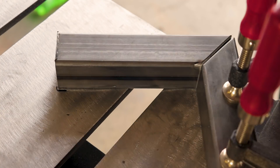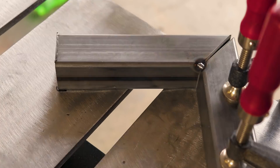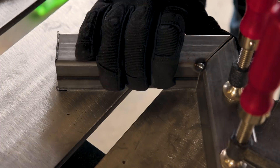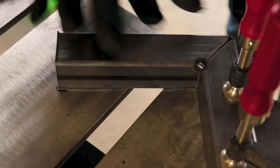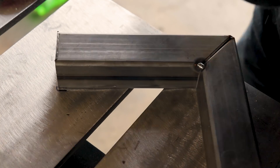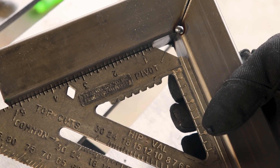Right here I'm just squaring it up and then putting a mark so that you can watch how much it pulls from just the one tack. I put it on the inside so you can see that. To get this thing squared at 90 degrees I have to have an opening on the back side. I tacked that up and then off camera I tacked up the other open corner side, and then the fillet last — and it stayed nice and square after that.